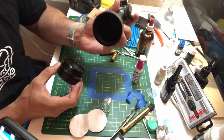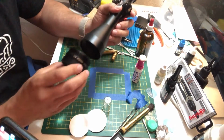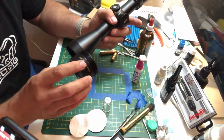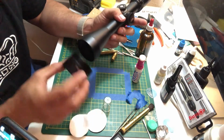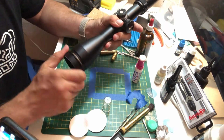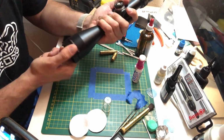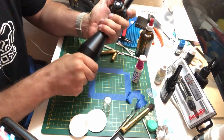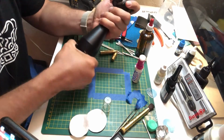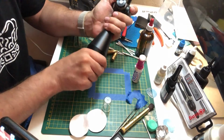And that's what you see inside the scope. Oh, not much, just a tube. So I'm going to put this one back, and this thing just freely goes here. There's an O-ring, a seal. All these scopes are watertight, so you don't have to be afraid of the weather. I think before I disassembled it, it was even nitrogen purged. Well, not anymore. I have made it air filled. Air contains, I think, more than 70% nitrogen. That will work for me.